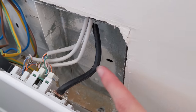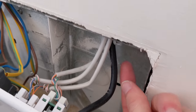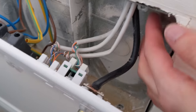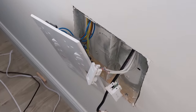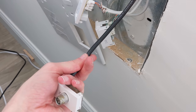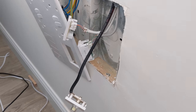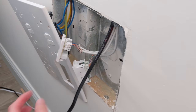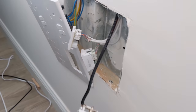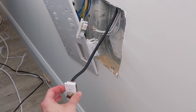Here's the aerial connection. What we're hoping is that if we can find this up in the attic we can pull it, and as long as it's not clipped or taped inside the wall we can pull enough slack through, attach a string to it, pull it back up into the attic, and then pull network cable in alongside it. We've already gone up into the attic and found it. I deliberately pulled a bit up so there's a loop in the attic. My friend's up there now pulling the slack back - if he can do that, we've confirmed a clear route from here up to the attic.